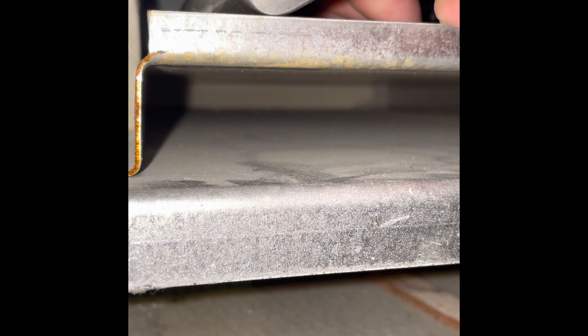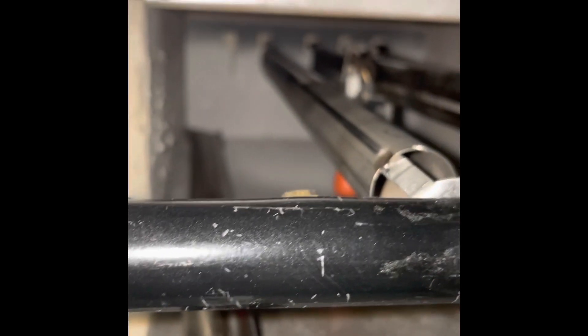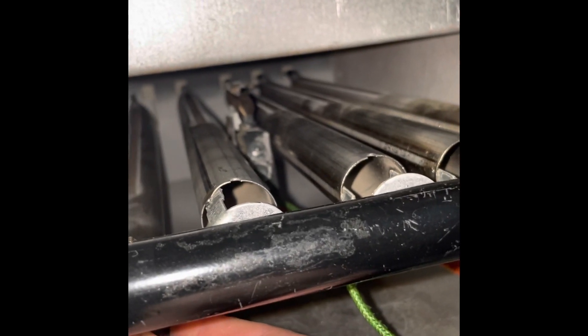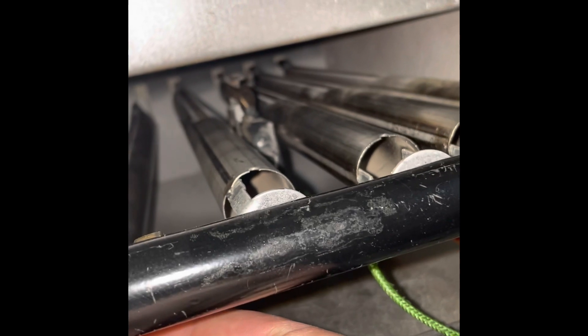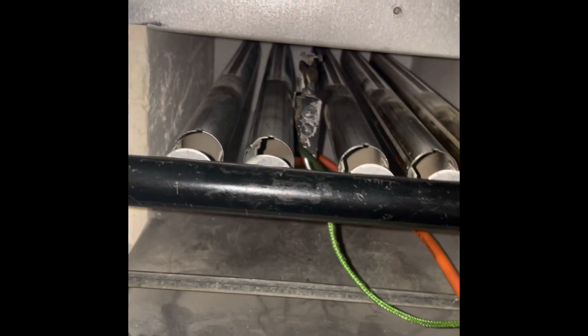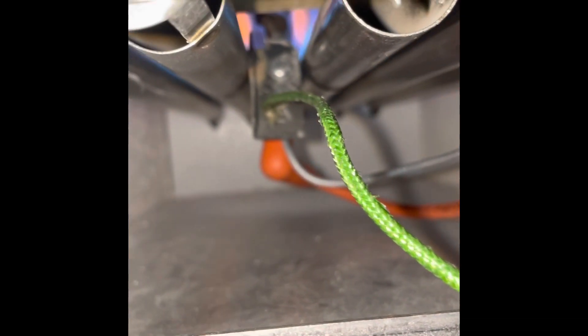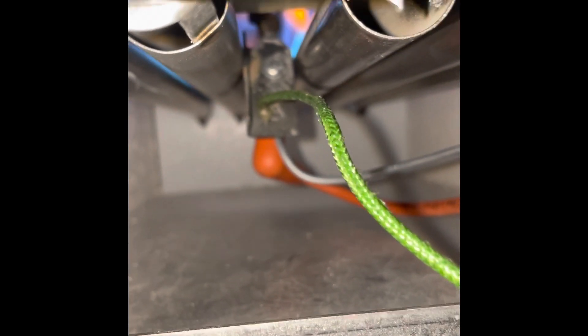Just kind of curl it in underneath, find that slot at the end of the tube, and slide it in. As you can see, that one is in. I need to put this back on, then I'll take this tube here, look for the slot on it — it can be tricky, so take your time. Everything looks good. I'll put this piece back on and put a call for power. We're at the breaker — kick that on. Come down... that's a good sign — flame! Simple fix, sensor-wise.